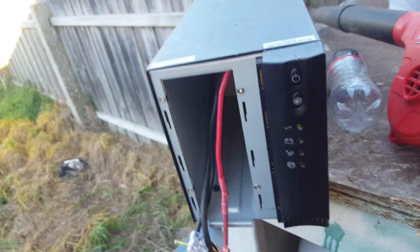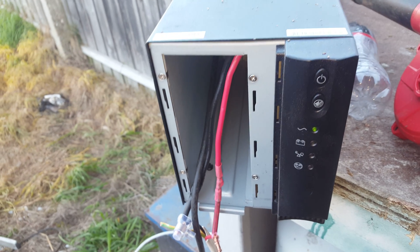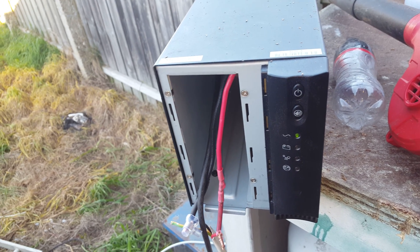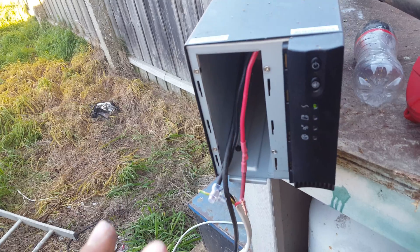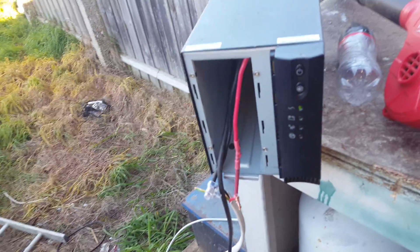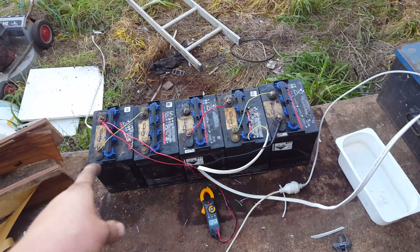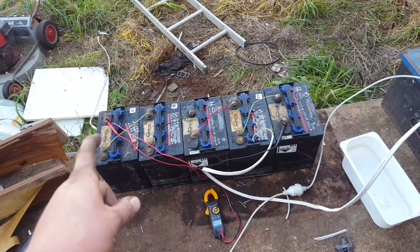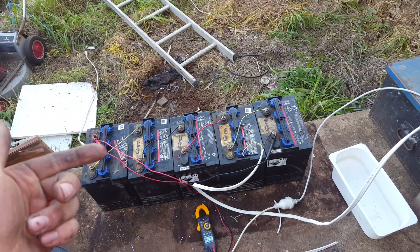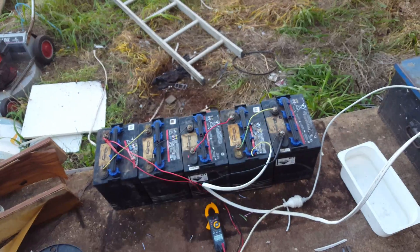So there you go, that's a win. Now I've got two massive great big rack mount 1,500 VA, 1,000 watt UPSs to play with as well. If this battery bank holds up a little bit, this is going to be awesome. I'll make a DC to DC charger to charge these with low voltage rather than inverting from 12 up to 240 and then charging down to 40 — it's just silly. Anyway, thanks for watching. More updates soon. Catch us on the next video.